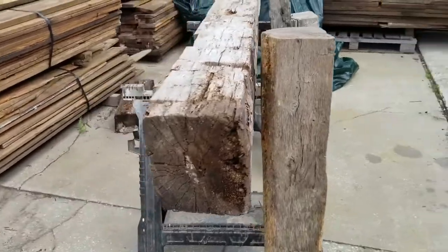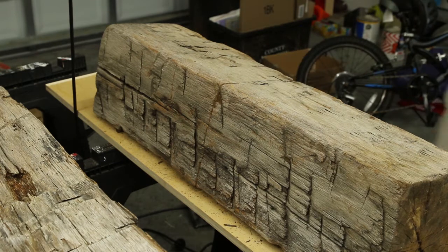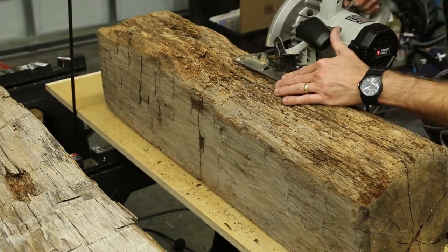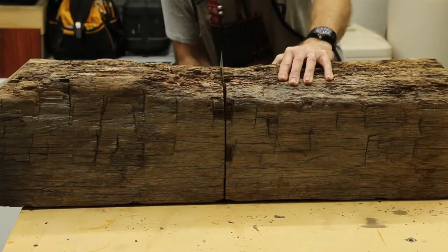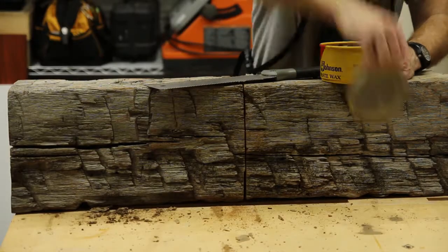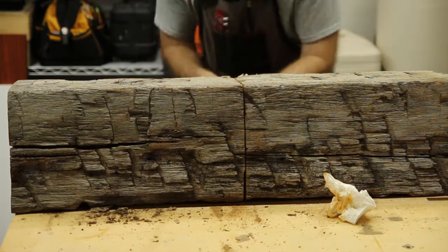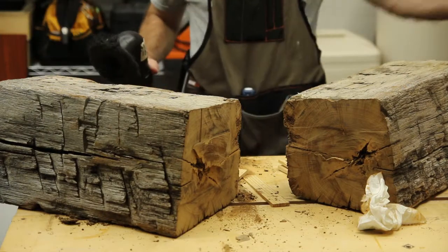After loading them up, it was time to give these beams new life. First things first, I cut this piece in two for the legs. I marked some rough cut lines with a speed square and then started sawing. I cut it full depth with my circular saw on all four sides, knowing that it would not cut all the way through — just cut, rotate, and repeat. After that, it was back to the bench to finish the cut by hand with a Ryoba saw. With this method, the cuts from the circular saw are rarely perfectly aligned, especially on an irregular piece like this. The blade of the Ryoba was getting pinched and distorted, which made it really hard to pull through the wood. I tried waxing the blade, and this made a huge difference. I was shocked at how much it actually helped — I will definitely be using this technique again.